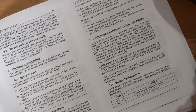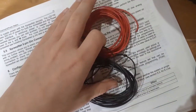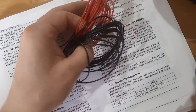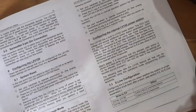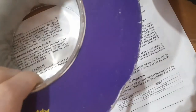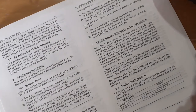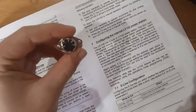That's 300 milliamps of power to both ExpressNet and the power station interface, and you can add your own auxiliary 12-volt regulated DC if necessary. Some networks require slightly thicker cable — for example the NCE Power Cab takes track power so needs thicker wire. For ExpressNet all you really need is ethernet. I've got a 100-metre reel of Cat5e here — it's just what I could find cheapest on eBay, £12 for 100 metres. That's a very good deal.